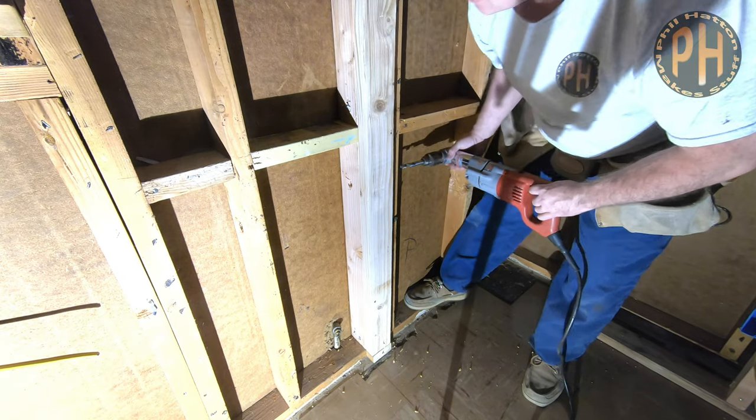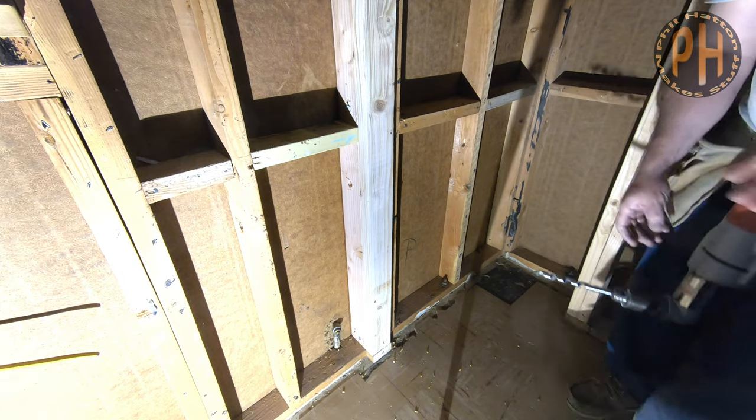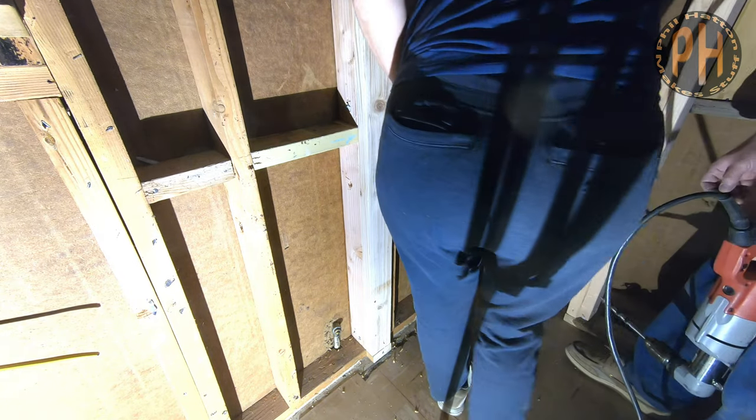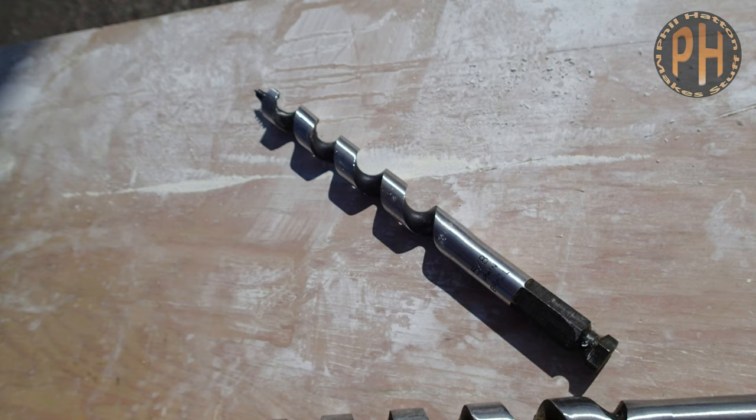Anything more than a couple of circuits and it is probably worth borrowing or renting a right angle drill and getting auger bits in a few lengths, including a long one called a ship auger. But be sure to get ones with really beefy shanks around 7/16 to 1/2 inch. Depending on how many wires you're pulling, you can probably get away with one size 3/4 or 7/8.